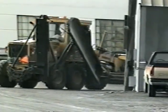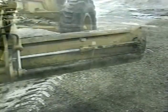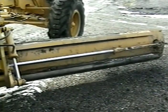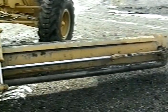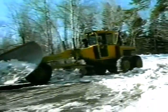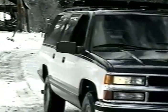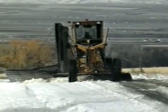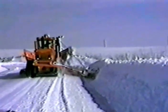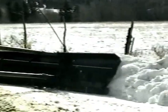A frozen gravel road can withstand a little more pressure than the same road when it is not frozen. A paved road in good condition can withstand even more pressure. Obstacles such as manholes or expansion joints must be avoided, so when pressure is adjusted on the moldboard, it is probably better to err on the side of too little pressure rather than too much, especially if you do not know what obstacles might be ahead. It is also helpful to be able to see some of the shoulder behind you as a guide to keep motorists from running off the road. The wing should be casting snow into the ditch without leaving a windrow. If the ditch is already full, raising the heel of the wing to leave a gentle slope upward at the edge of the road will minimize future drifting.